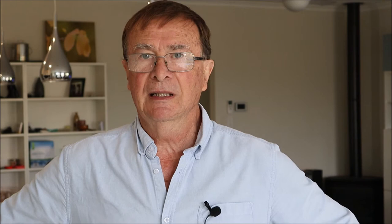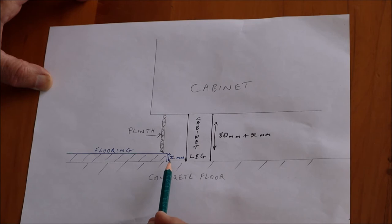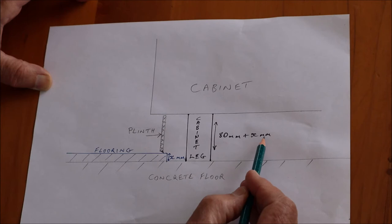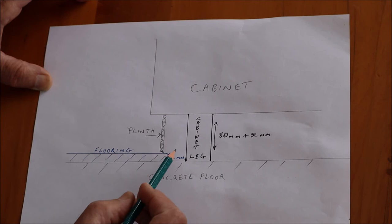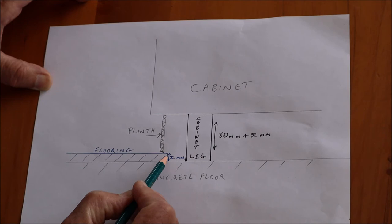The way you get around the flooring thickness problem is to estimate the thickness of your flooring and then raise your rail by the same amount, so that you end up with your plinth on the final flooring and not on the concrete. Here's the situation in diagram form: if you put your legs on the concrete floor before putting in your final flooring, the height of your flooring — call it x millimeters — will take up some of the space for your plinth. IKEA recommend legs to be 80 millimeters long, so you'll have to make your legs 80 plus x, and raise your rail height by x. That means a lot of trimming of your plinth, which is a real headache. I'd estimate flooring thickness to be a millimeter or two more than it really is — it's better to have a small gap than to have to adjust your plinth.